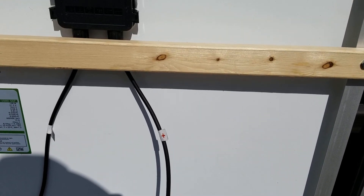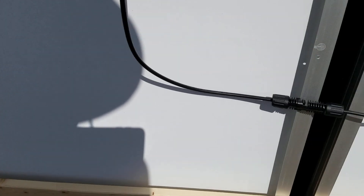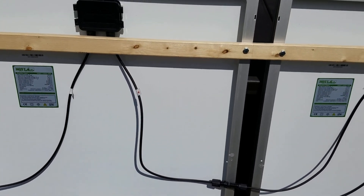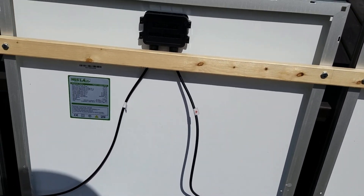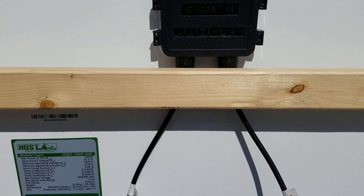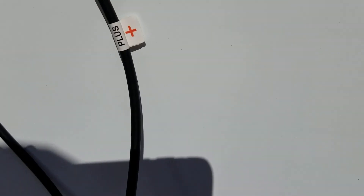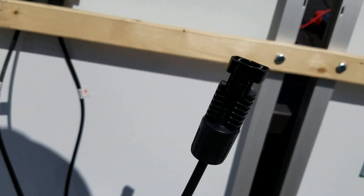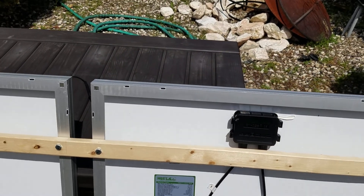This is positive and negative from one panel — the negative from one panel goes into the positive of the other. It cannot go into the negative unless you have a special parallel adapter. So you can't really mess this up if you want to do series. If you do it in parallel, it's different: the voltage stays the same and the amperage is additive — the opposite of series. So for series: negative into positive, negative into positive. Then when I measured it, I used the negative end of this one and the positive end of this one — that's it.